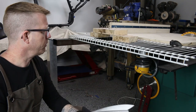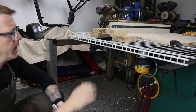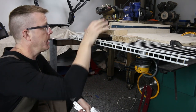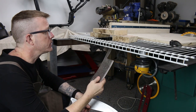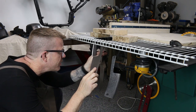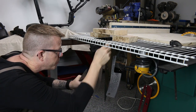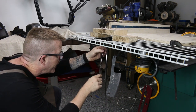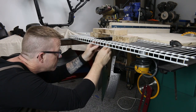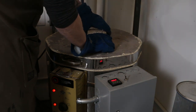Here's my little setup for hanging and cooling knives after heat treating or annealing. I've got just a piece of wire shelf clamped down to my table saw so it can't move, with fire bricks on top, and then I thread my blades down onto the TIG wire. Something to take into consideration: the next time you touch these they're going to be very, very hot, and you want as little room for error as possible. If these TIG wires get tangled up on the way out of the kiln and get caught, that's a problem — so keep them bent towards the top.